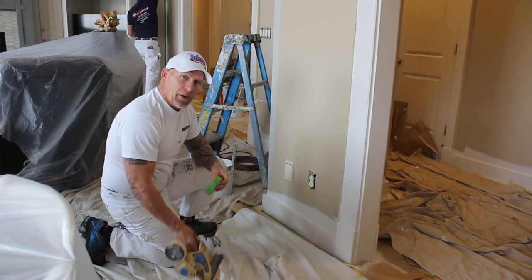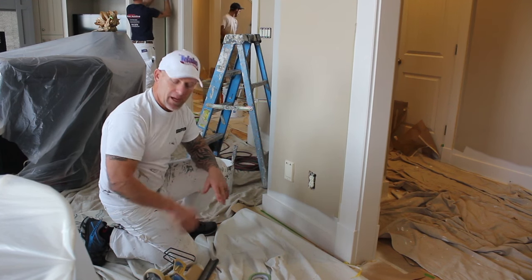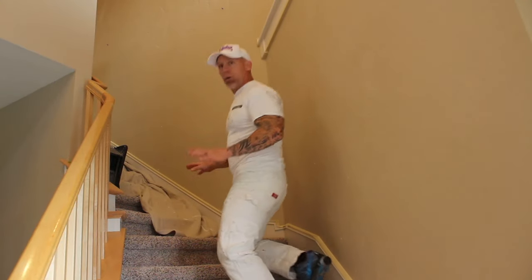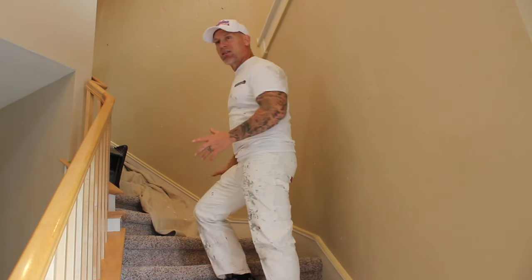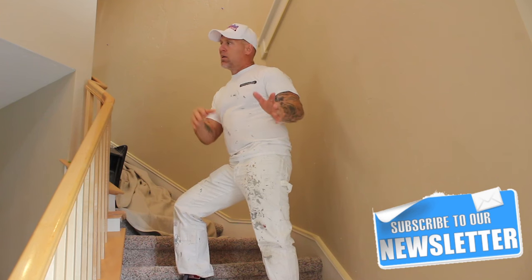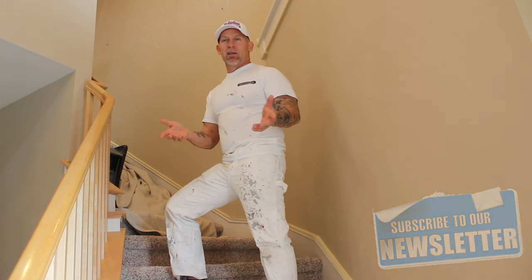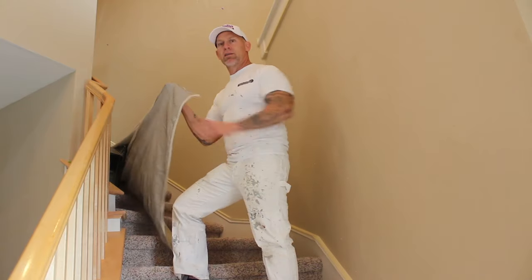Once we get all our paper run around our hardwood floors, we just lay our drop cloth down over the top of that. For carpet, instead of frog tape, we use inch and a half tape to run along the carpet and tuck it underneath the baseboards, then go over it with our 3M hand masker with one inch tape and nine inch paper. Working up these stairs, we've got trim along the stairs so we don't have to mask the carpet, but we'll lay drop cloth down covering the floors going up the stairs.